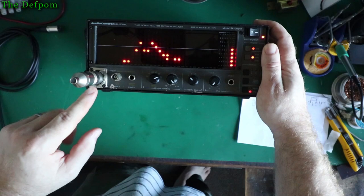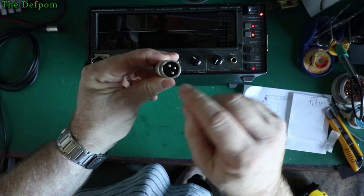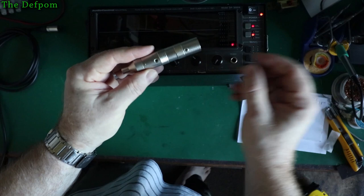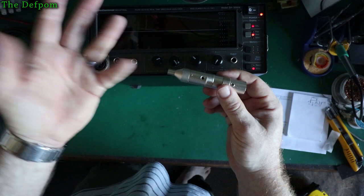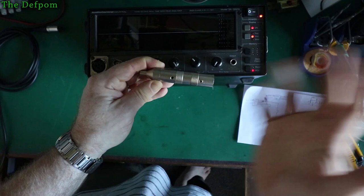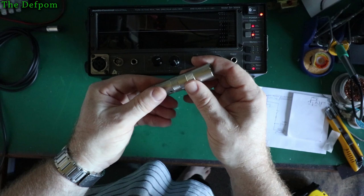It's got one screw you take out, and there's a little circuit board inside, and that whole assembly is pulled out with that connector. It's just got a wire which runs to the actual mic element on the tip, with a little hole through the centre of that. The original wire had joins in it, which I think is probably from the factory, just the way they manufacture it. It was heat shrinked and looked fine, but I noticed the board has some resistors. I should actually pull it apart and show you, shouldn't I? Let's pull it apart and show you.